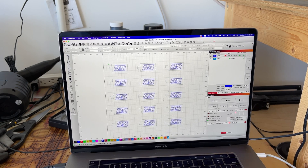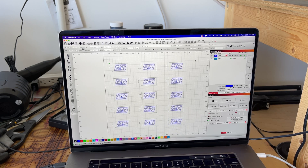Now our next step is to go back into Lightburn and set up our engraving files, which I've already done. The bright blue color is what's going to be engraved. For my fill settings, I have it set to fill, 6000mm per minute, 100% power, one pass, and I do a 0.08 line interval on these. Now that it's all set up, I'll be able to click start and the laser is going to start engraving the keychains.